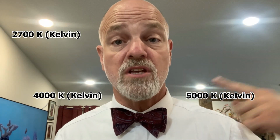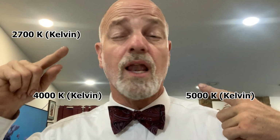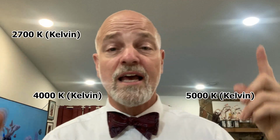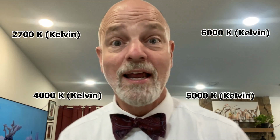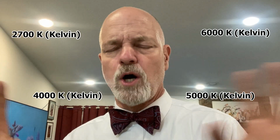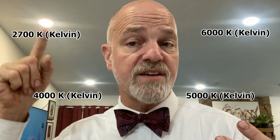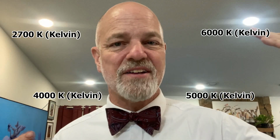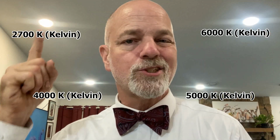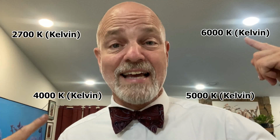Now, very common, you see the 5000 Kelvin and you'll see the 3000 Kelvin, which is close to this. That's what you see a lot of times in big box stores, hardware stores. And this one up here is 6000 Kelvin. This one up here in the corner. Now, okay. A lot of terminology thrown at you. Don't get overwhelmed by the terminology. Just notice the number increases: 2,700, 4,000, 5,000, 6,000. I could have left this at 3,000, 4,000, 5,000, 6,000, but I wanted to show an actual incandescent temperature bulb up here for a reason, because I want to talk about how our eyes see these.